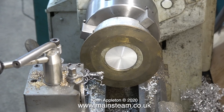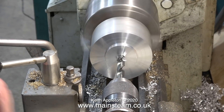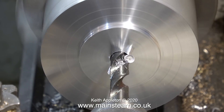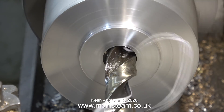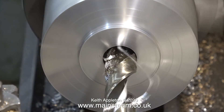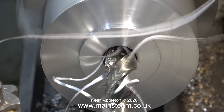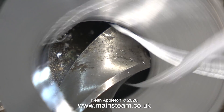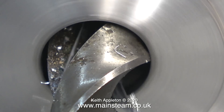The good news is the brass part is a perfect fit on the aluminium block. It's time now for a drilling frenzy — first of all with a small drill and then working up the sizes until I get a reasonable sized hole in the piece of aluminium. I've really speeded this up. When you work with aluminium it's very important to use very sharp tools. These drills are one imperial size down from the sizes I would normally use, so therefore they're slightly sharper.